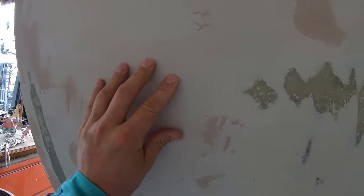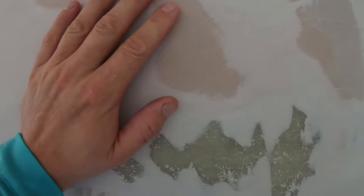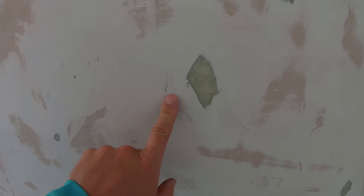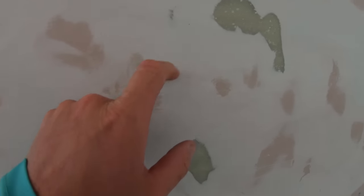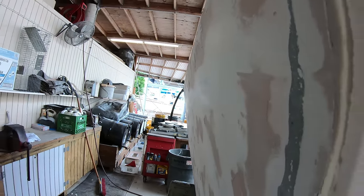It's best to use a large trowel on the big spots and a smaller knife on the smaller spots. The same thing goes for the inside of the transom — we want to continue filling in the spots and trying to level off the surfaces. The smoother we get it, the better the gel coat will look. We will basically continue filling, sanding, and leveling over and over again, getting all the surfaces as smooth as we can.